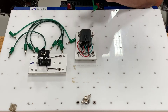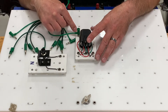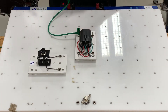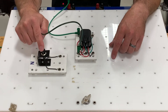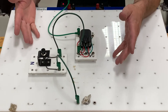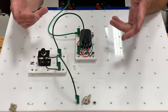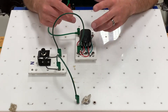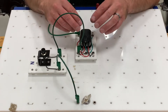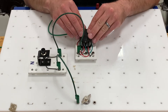I'm going to utilize my ATEC board and turn it on. I've got 12 volts up at the top on this red pin. I'm going to take that to pin F on my relay board. The other pin that we saw to have resistance was pin D, so I'm going to put a connection at D. We're going to utilize this momentary switch in order to control the relay. Once I get all that hooked up and push my button, I can hear an audible click coming from the relay. That click is confirmation that movement is happening, which generally means that the electromagnetic portion is functioning and pulling the switch closed.